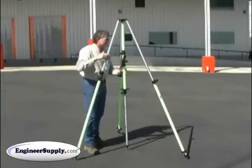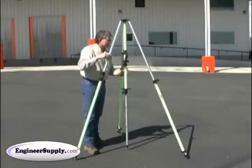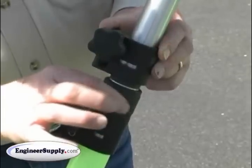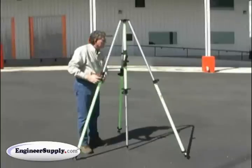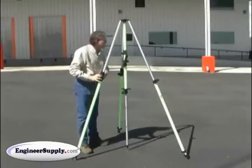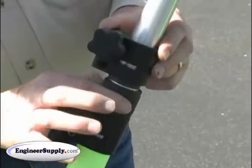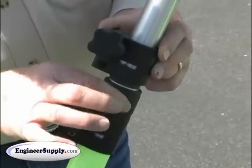Stand between two legs, just holding the two intersections — you can move the tripod around. Turn the center pole until the bubble is facing you and center it until you get it very close to center. Then go one leg at a time and you can move the leg very precisely in one direction until the bubble is close to center or centered in that direction.